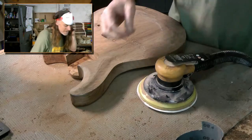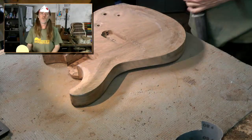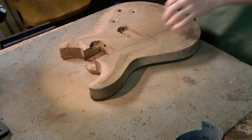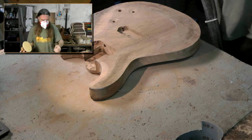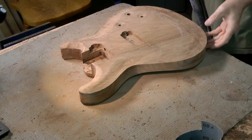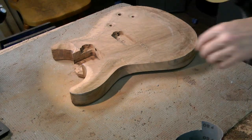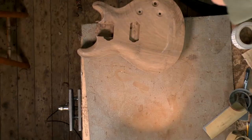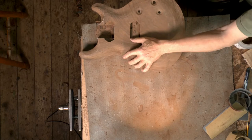Right, now I'm going to fire up the beast and I'm going to sand with 80 grit this beautiful piece of 400-year-old walnut. So the old meets the new. Mask on. So I'm going to sand around the edge first. I'm going to do the edges first and then the back, and then I'm going to do the front last. So Carol's going to try and follow me on the camera because I'm going to be moving pretty fast. I'm going to start on the edge here, Carol, overhead cam. This will probably take me about 10 minutes to do the whole thing.